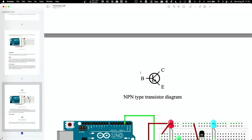If you have silicon in a crystal, how is it going to buddy up with other silicon atoms? What would you expect? How many valence electrons does the atom want to have? Eight, but it only has four. So how is it going to get eight? Well, it can share a pair with a neighbor, and if it shares a pair with four neighbors, then everybody's happy. We all got eight valence electrons.